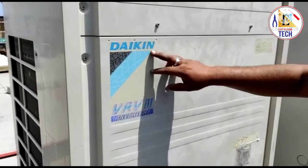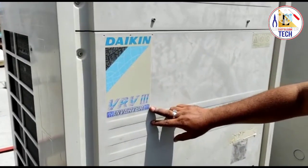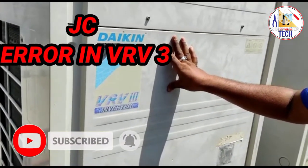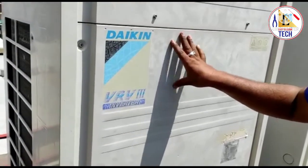Hello my friends, this is the VRV3 system, this is the other VRV3 inverter. In this we have the issue of low pressure switch, issuing the error JC. JC is the error for the low pressure switch. Let's see what is the problem in this system.